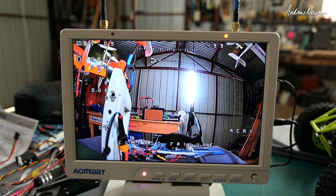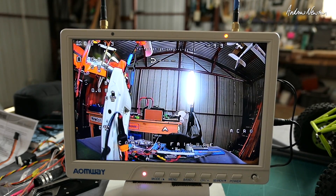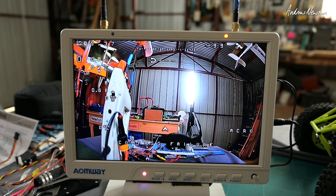Can I make it a bit better to see? There we go. And if I turn the radio off we should see — it's warning me that it's still powered up. That should drop to zero. There we go — RSSI has dropped to zero. It may be a different range to what I'm used to with FRSky. I'll turn it back on again — RSSI pops up again. It was actually dropping down to 97 or 96 occasionally out in the field, but it does seem to read pretty high values.